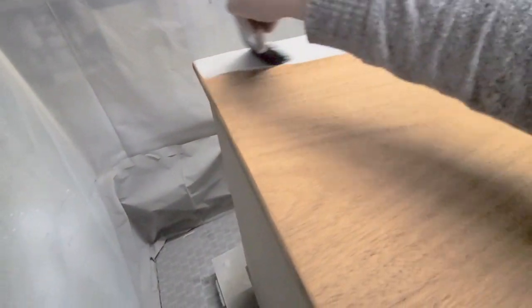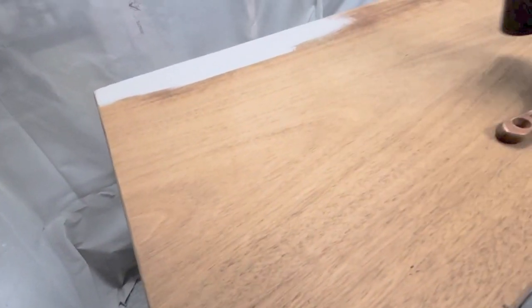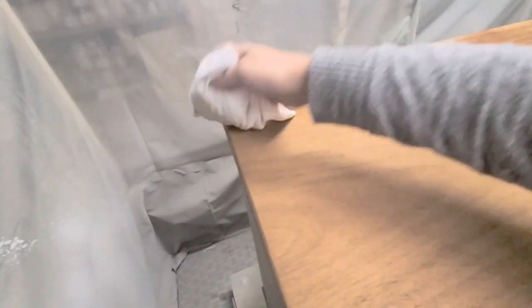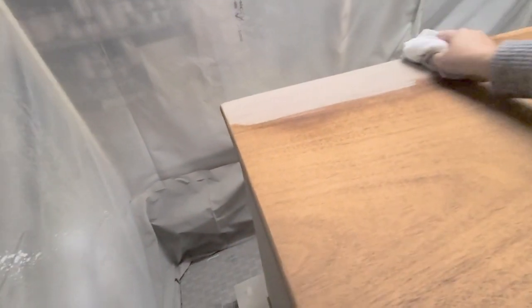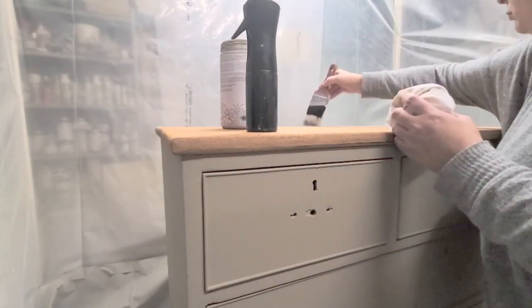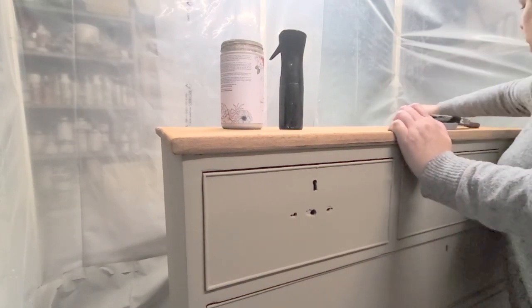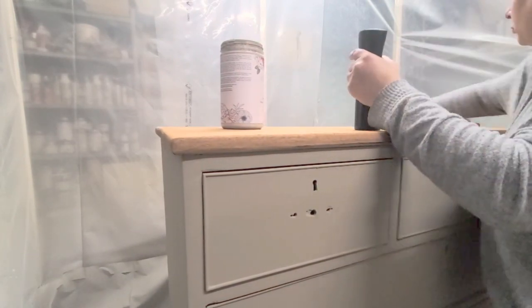The top was now raw wood, so I did a wash of Soiree, which is Country Chic Paint — a very very light beige. I sprayed a water mist onto the paint and wiped it off with a lint-free cloth, giving it a wash look to the whole piece. If it starts drying, spray some more water onto it. I continued this across the entire top, making sure to get the side trims and the front. This mist bottle is available on Amazon — I'll put it in the description — it was about $17.99 Canadian and has different mist spray settings.